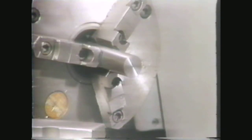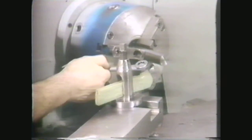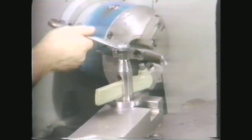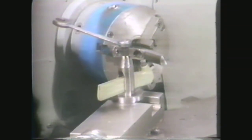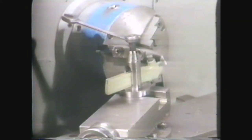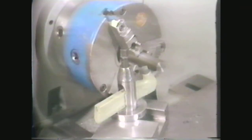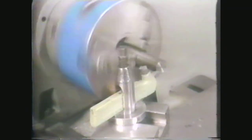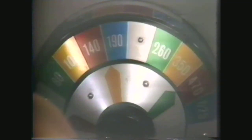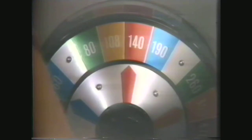This demonstration will cover how you make a radius on the outside edge of a faced workpiece. Set up a concave cutting tool bit in a straight tool holder. Align the holder in the tool post so that the cutting tool is at center height of the workpiece and in a position to produce the desired radius on the end of the workpiece. Forming tools require a slower cutting speed than straight-turning tools, because there is more of the tool in contact with the work. You can make a good estimate of the spindle speed to use in turning a radius by starting at one-half the straight-turning RPM for the material.